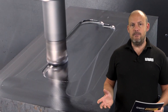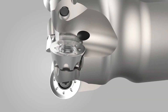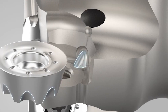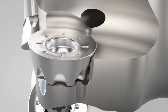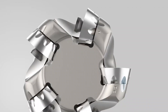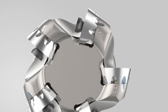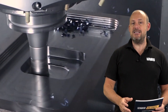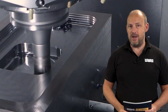With this simple anti-rotation method, the insert is locked in position, which gives you that process stability when machining. There's no vibration, the insert's not moving in cycle. And secondly, when the insert edge is worn, you can literally move it to the next position. So this solves two problems: process stability, and making sure you get the most out of your inserts.